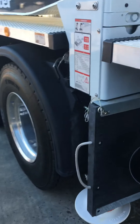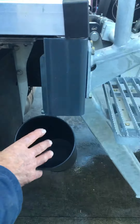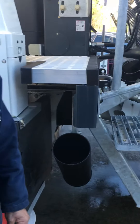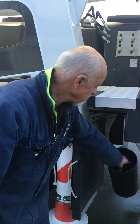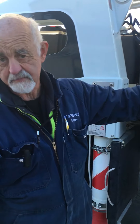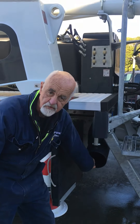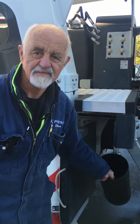What's this little black contraption here for Mr. Toombs? You put your sponge balls in it, fill it up with water about half full, sponge balls go in it, you drive to the job, and the sponge ball soaks up the water. When you're ready to clean out you take your sponge ball out and put it through the line. When the water gets dirty, you simply put it upside down and the water runs out. Very, very good idea.